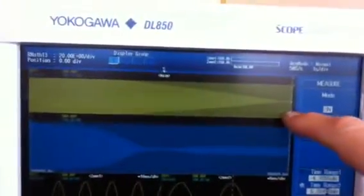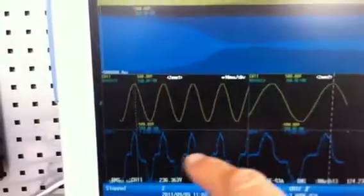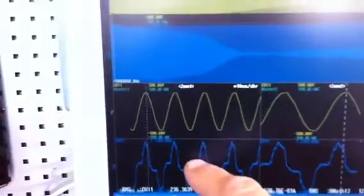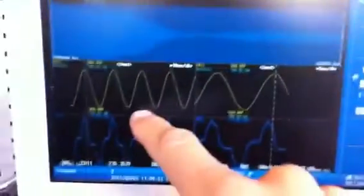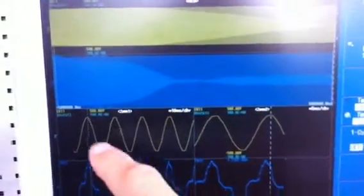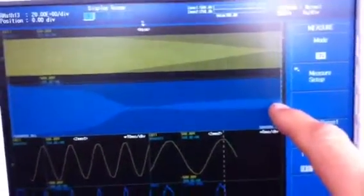Since this is broadcasting, I've already done a sample here — we did this at the same time. We're measuring 10 seconds with the voltage through the 100-to-1 probe and the current through the Hitech current sensor. We've zoomed in at the start, and this second zoom is at the end, so you have two zoom windows — one at the beginning and one at the end of the signal. We're only measuring the values between the cursors: one cursor is at the peak voltage value at the start, and one is at the peak value at the end.